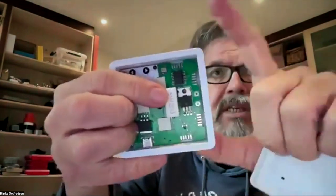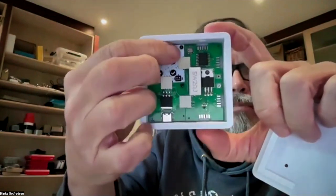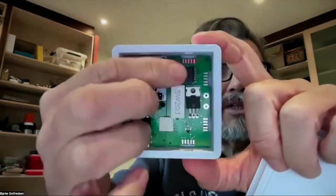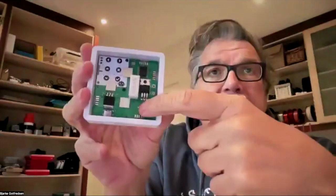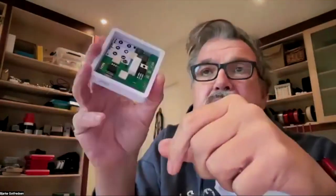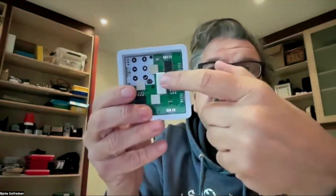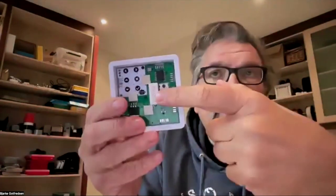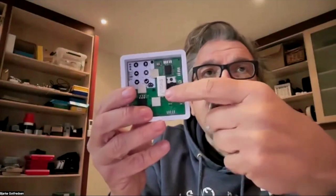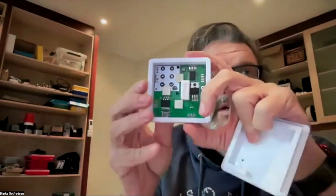This works with I2C. This unit here asks the temperature sensor, which sits there, what the temperature is, and then depending on the temperature, it turns the heater on or off. I put this in a deep freezer at -22 to see how it worked, and the duty cycle is around 8%. That means 8% of the time I have to turn the heat on. Typically I turn the heat on for like 20 seconds and then off for like 2 minutes, whatever that duty cycle matches. I do that so it keeps the temperature at 0 degrees Celsius.